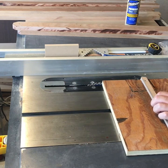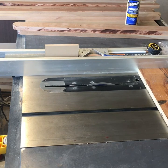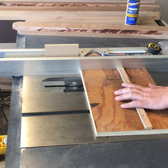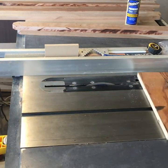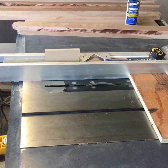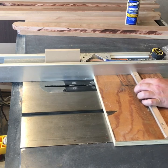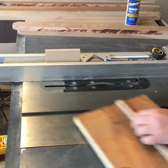What I'm doing here is cutting about a 3/8-inch groove just to hog out some of the material to make it easier for the router bit. I'm going to do two passes — one a little down and one farther down — just in case I use larger material for my half circles.